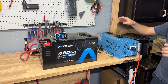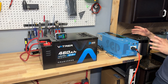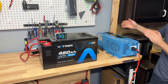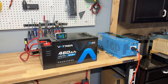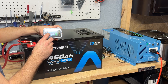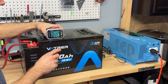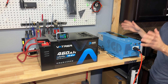I have the battery fully recharged and our current shunt reset to zero. We're going to put a 0.2C load on this battery, which is going to be about 90 to 92 amps. We're going to use the Sun Gold Power low frequency pure sine wave inverter running a battery charger to give us our load. We're sitting at about 89 amps — as close as I can get without overshooting the 0.2C goal. The total amp hours on the shunt will give us our final result once the battery is completely discharged and the BMS shuts down. Should take about five hours.